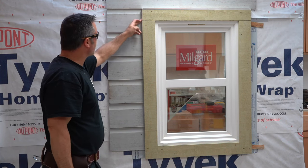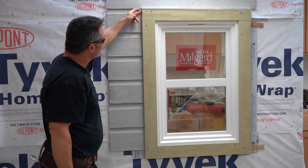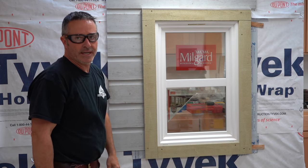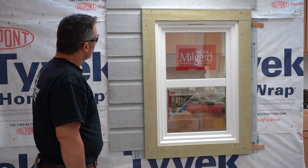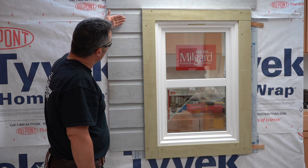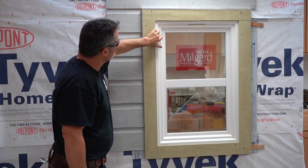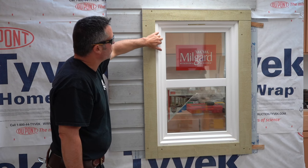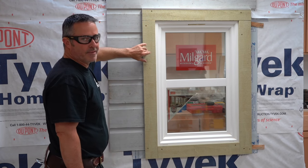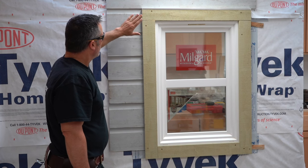That's one way to do it. Having this groove on it is a little bit of work to caulk, but it can be done and it's a very nice look. The other way would be to run the siding all the way through before putting on the 2x4, running it to the window itself, and then mounting a 1x4 — not a 2x4 — over the side.